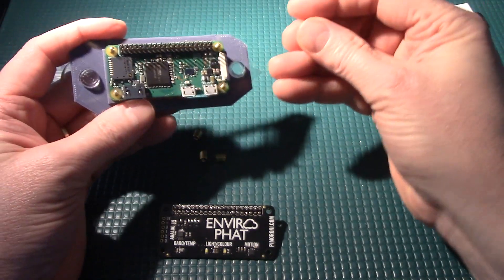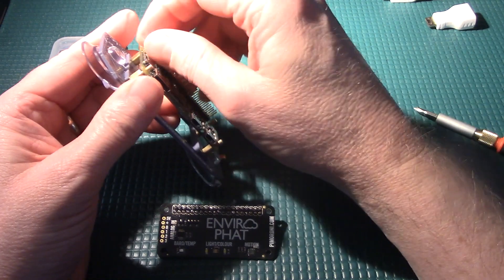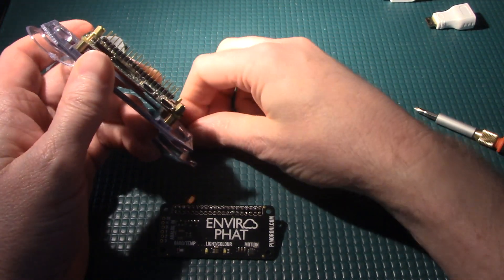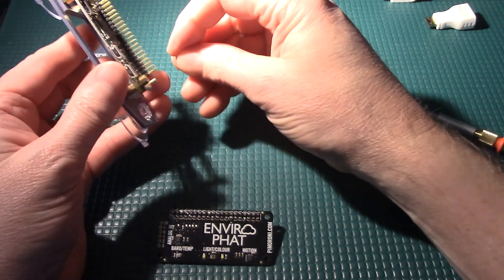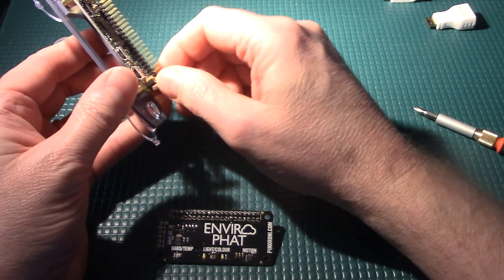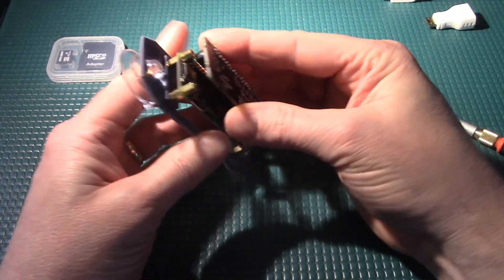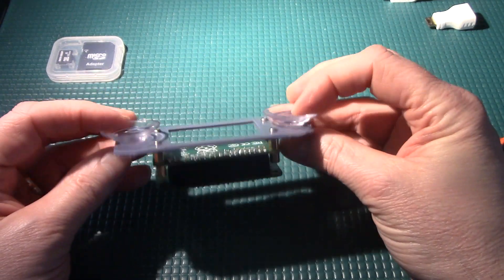Next up are these little spacers I can use to help hold the Raspberry Pi in place. It's probably not necessary — I think everything is going to stay put. We're not going to be subjecting it to any really harsh movement; dryer vibration is what we're hoping to pick up, but I don't think it's going to knock anything loose. Right now they're just finger tight, but I'll go back with a little wrench or pliers and tighten them up. The last thing is to get the EnviroP hat — you have to make sure you line it up correctly on the 40-pin header; you don't want to bend anything or get it misaligned. It's there nice and snug, so that's our EnviroP hat — we have everything pretty much ready to go.